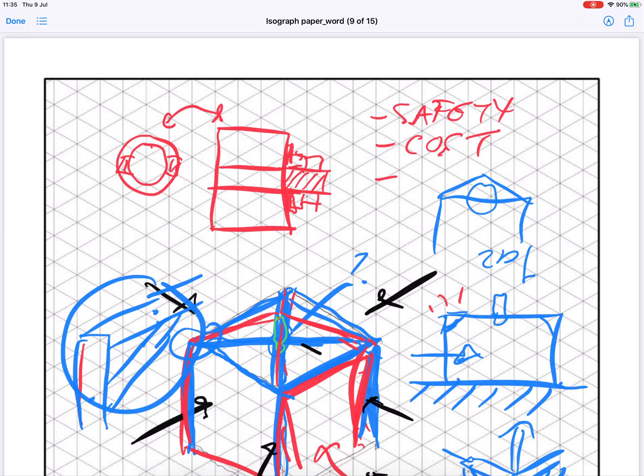So definitely check all those joints, make sure they're really safe. You mentioned there's a bit of yaw in there. That's because you've got this kind of parallelogram effect going with some of the joints, and you want to really make sure you brace it up so it's nice and safe. So in any consideration with design, you want to make sure it's really safe, and that will be to benefit of yourself and anyone who uses your gazebo.